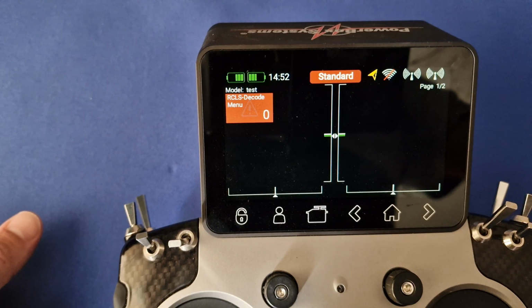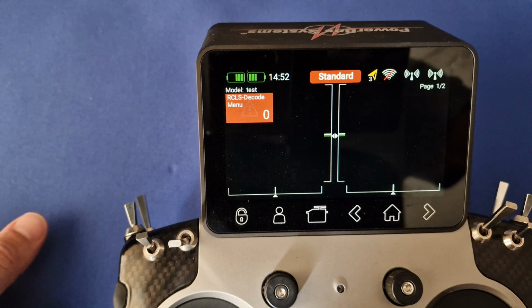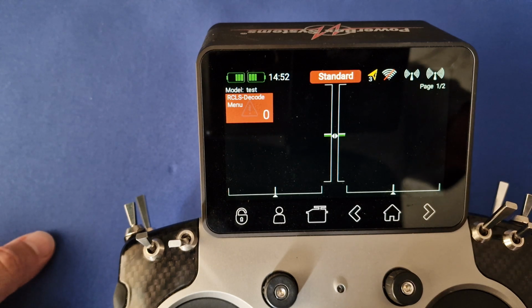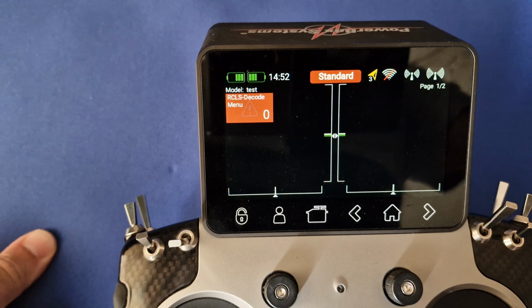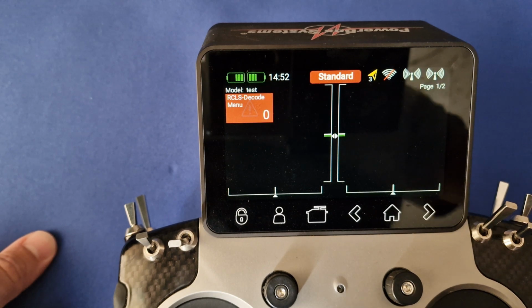This will show you how you configure the serial expander when you're using the Powerbox Core or Atom radio systems running over P2 bus. The expander's out of shot. Those that use the Powerbox radio systems know that if the receiver is anywhere near the transmitter, it starts to swamp the output. So it needs to be a little way away for a good signal link. It'll work for a long distance, but not close up.